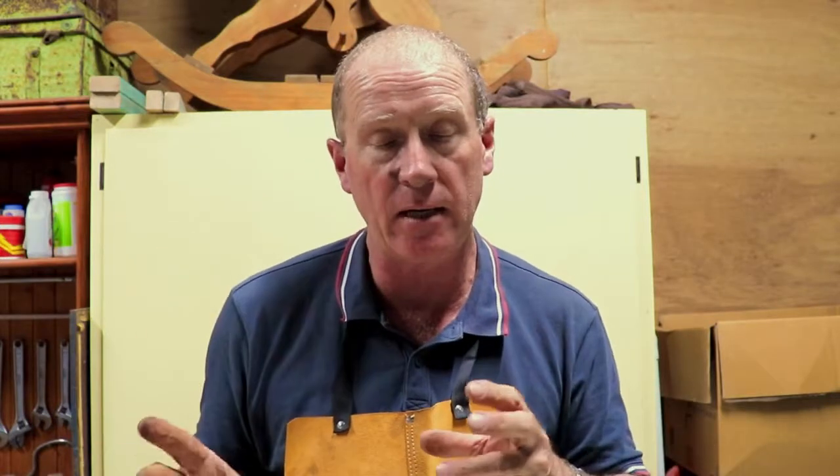So ladies and gentlemen, there you are. We've forged the spring now for our little leg vise. It's opening and shutting correctly. It's all in the proper alignment. That is the way that that vise is supposed to be. I threw out that little spring that someone had put in there. I didn't want that. I want it to be as original as possible. Plus, I wanted to show you guys that if you do get a vise, and it doesn't have a spring or it's the wrong one, it's a very simple project. Even if you're a rank beginner, you can complete that project. You can have your vise the way you want it, or any other little parts that might be missing.